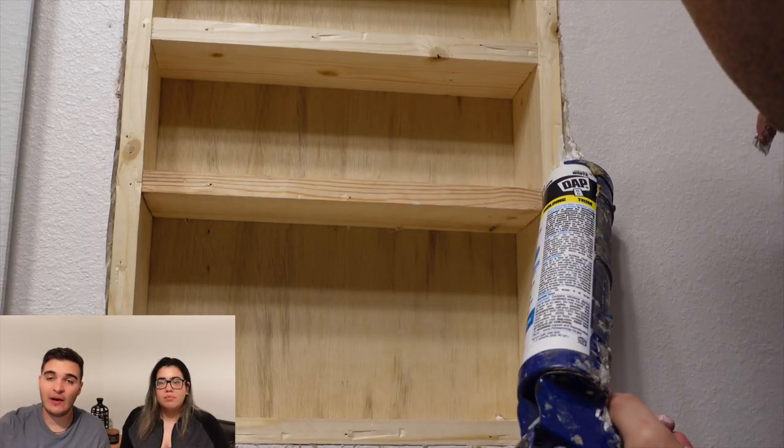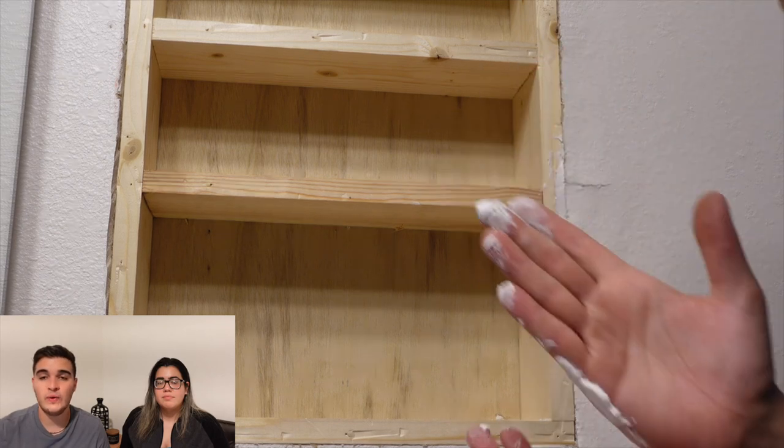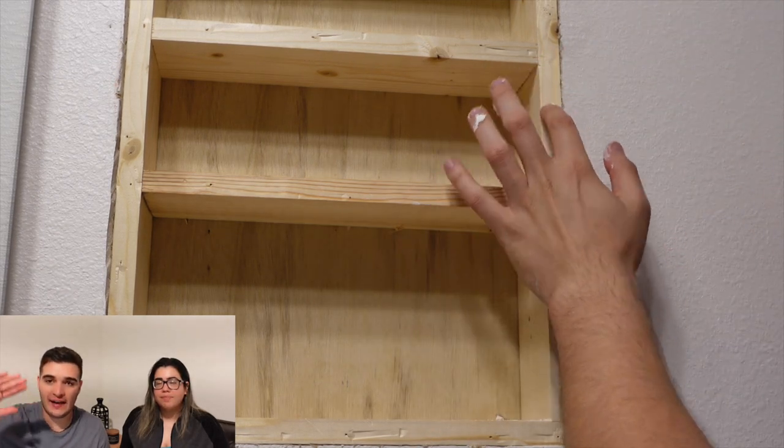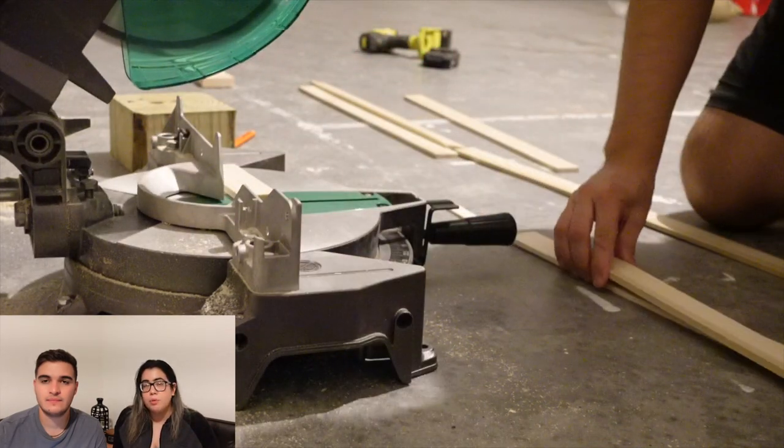It turns out that the reason it wasn't going in was because there were two little nails that were in the way. Unfortunately, I didn't notice and some damage happened. To fix the broken sheetrock, we grabbed a very skinny flathead screwdriver to carefully remove all of the debris. Once that was taken care of, we used caulk to fill it in. Note: you can also use compound if you'd like — we just used caulk because it was easier to make it flat with your fingers. I'm not going to say this came out as smooth as we wanted, but we knew that the door was going to cover it, so we left it. We let the caulk cure overnight and then moved on to the next step.